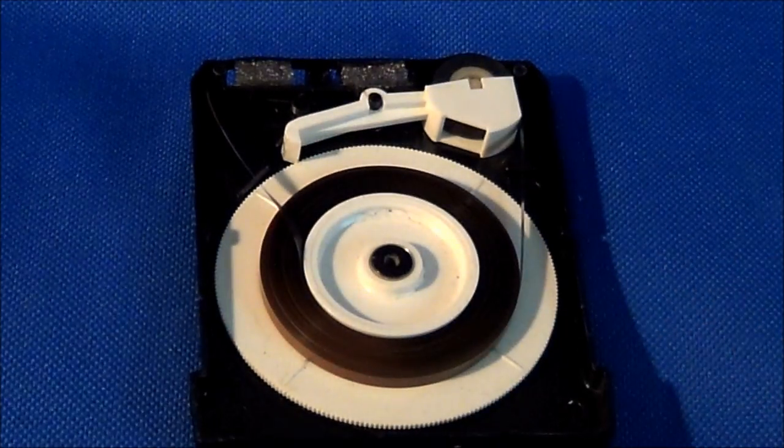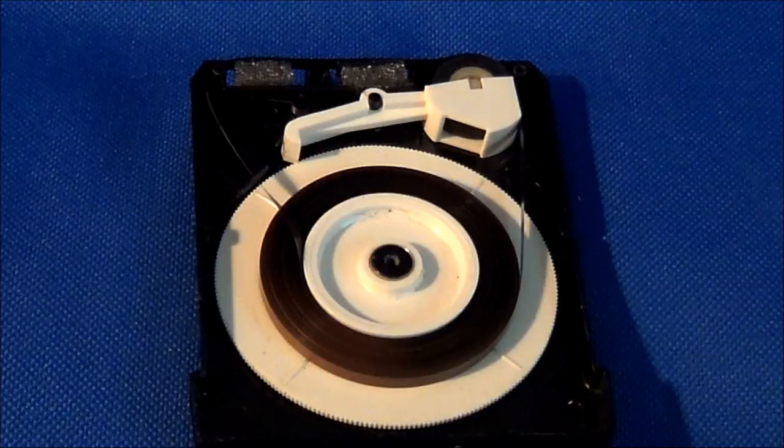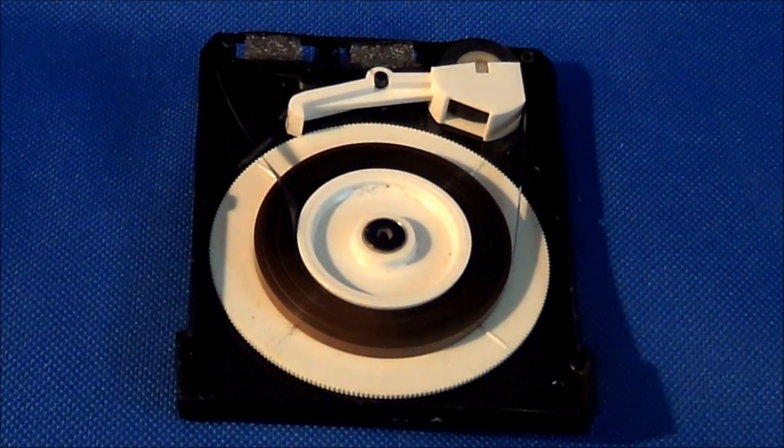Because you don't really need a foil one, do you? And in my experience with my 2 cartridges, I've found that mine have gone a bit sticky, not terribly, but enough to where I've been having to clean out the player after each use. And because of that, I think the tapes are extra prone to tension issues. And that's, of course, from the occasional bit of drag that happens when you encounter a sticky part.